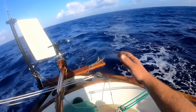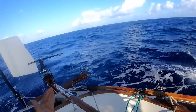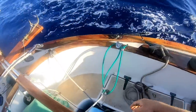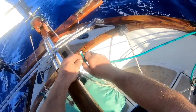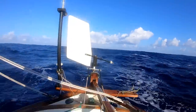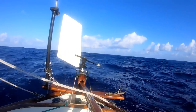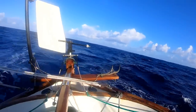You can see the way this is just — there's too much. It's kind of hard over one way, hard over the other. You can even see our course — just look at our wake. You can see a big S right there. So let's re-engage Boothby Hasler, which all we do is we take this, connect it here, take this, connect it there. And now watch how much straighter that is. You can see that the tiller is varying far less, and she's just moving right along, doing a nice straight course.